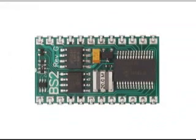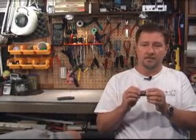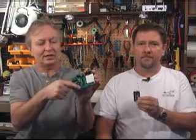Yeah. If you're going to use this one, there's a motherboard that this will actually install on that's got power connectors for your 9-volt supply, and there's got a piece of breadboard on it as well. Yeah, I believe this is called, well, I'm not sure what they call it, but this is one of the Basic Stamp carrier boards. It may be called the Board of Education. There's several different models, but yeah, here the module will just plug right in the chip socket here. You can put the components you're working in or with over on this side and the jumper wires and such. Put a 9-volt battery to it or hook a power supply, either one. And then this particular model has a USB port on it that you can plug into your computer to program the unit.